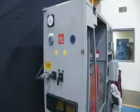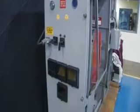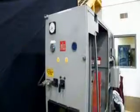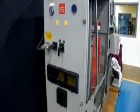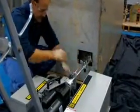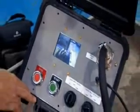Two types of systems are available, one for breakers with a lever-style racking system, and a second type for breakers with rotary racking systems. For breakers with a lever-style racking system, the Square D Services solution includes a set of components that are installed in each breaker cell. For breakers with a rotary-style racking system, a portable racking cart is utilized. In either case, a remote control station is provided so the operator can be positioned a distance from the breaker.